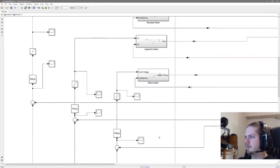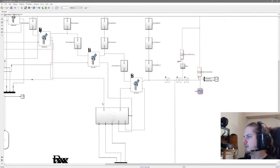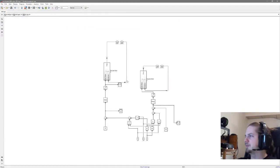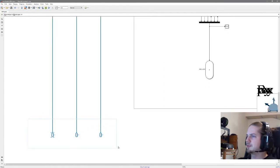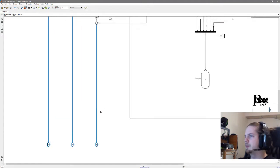And there are also two for the end effector, but I might not get too much into that since it's a separate system that's not as interesting right now. The input for the low-level controllers, or the reference, is defined as the input for the specific subsystem, where this subsystem is the plant of the robotic arm.